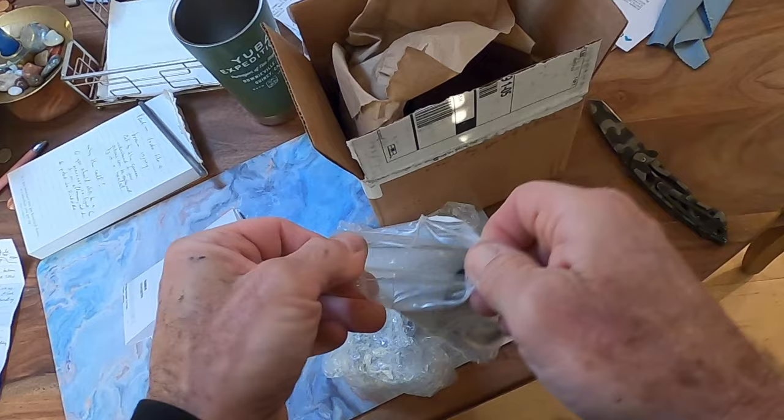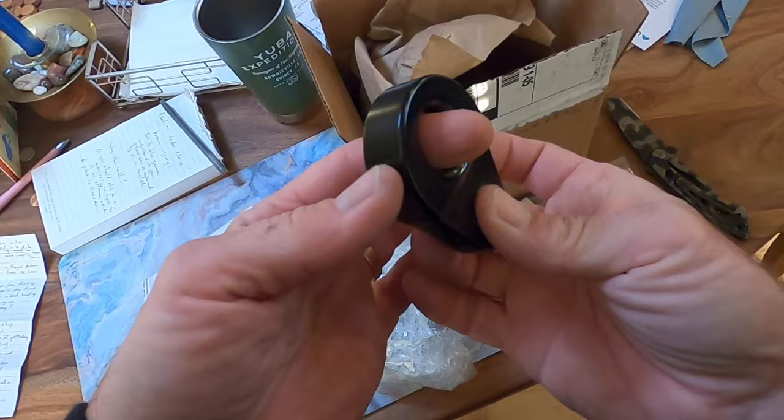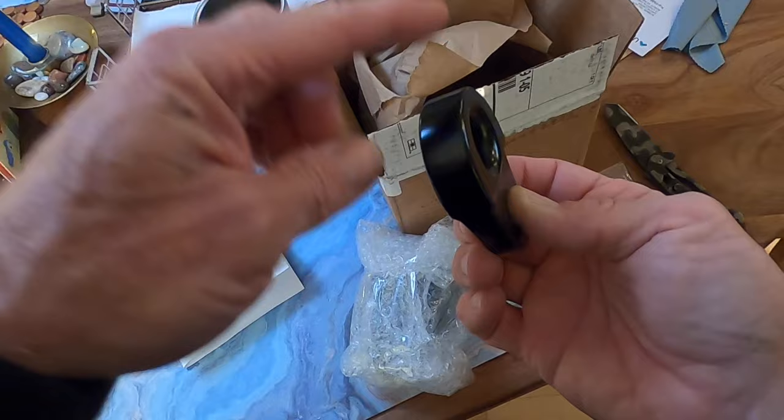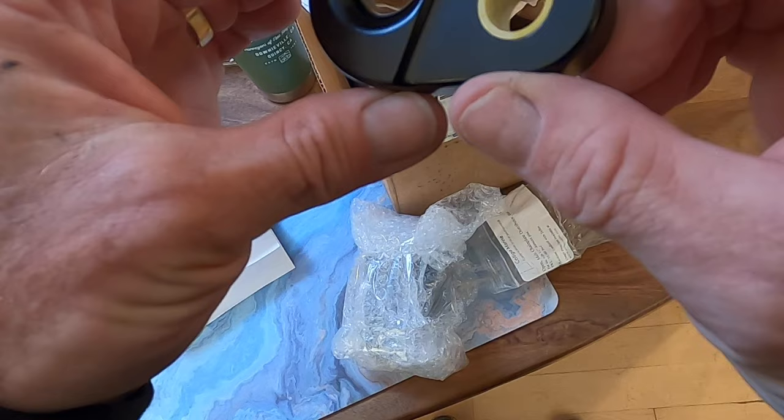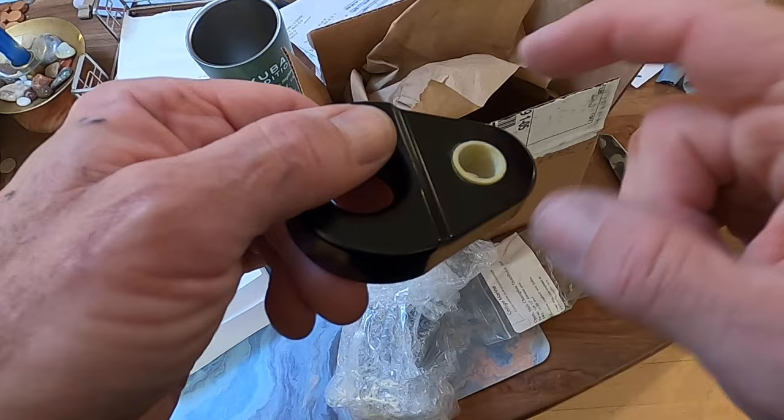Okay, here's a chain plate distributor for our new carbon chain plates. I need to now cut a notch in the plate and stick this guy in so the pin will go through here. And the super smooth area is where the adjusting lashing lines will go. Very nice. The anodizing is beautiful. Looks like G10 fiberglass reinforced plastic bushing here to keep the aluminum away from the steel and carbon.